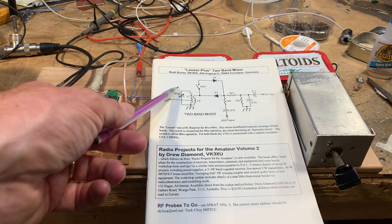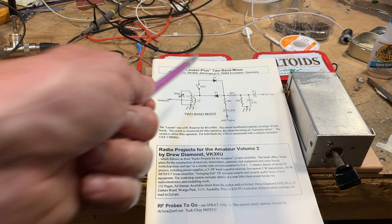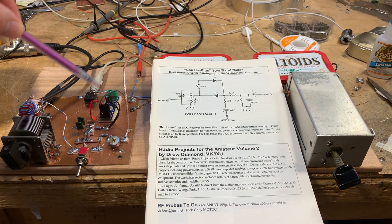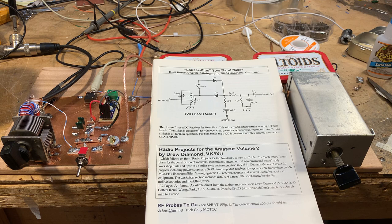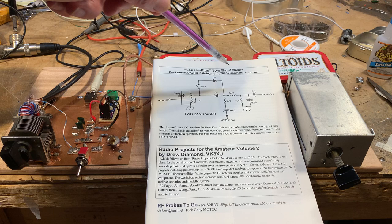Signal comes in the antenna and hits an LC circuit — that's what I have here, the LC circuit over here. From there it goes to two diodes, these two diodes right here. There's a switch that can turn from using just one diode to using two diodes — I'll get to that in a second. There's an output network that goes to an audio amplifier, this stuff over here. I have a little board with an LM386 on it, and it goes to a computerized speaker. That's why you can hear the CW. The VFO signal comes in from the amplifier here.